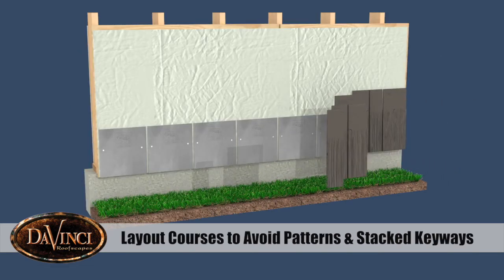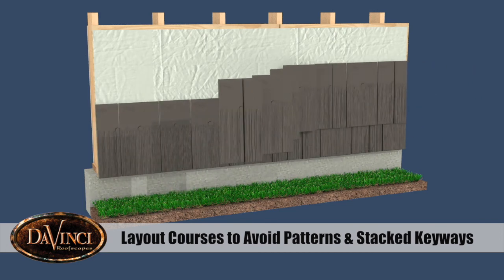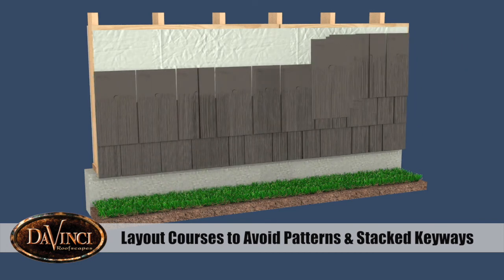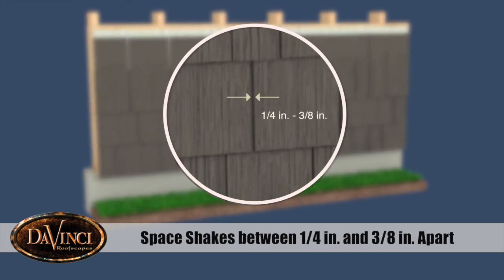As is common practice in an individual shingle installation, the installer must take time to lay out the courses as they proceed up the wall to avoid creating patterns in stacked keyways. DaVinci recommends the installer open multiple bundles to locate and note the size and quantity of shakes available and proceed accordingly. Space shakes no closer than 1/4 inch and no greater than 3/8 inch.